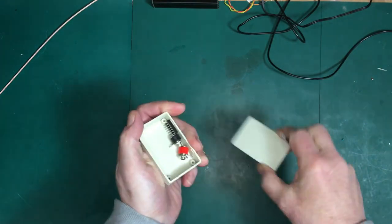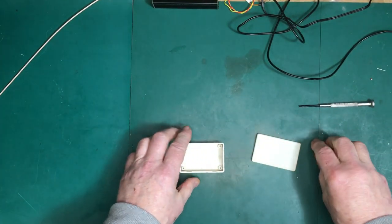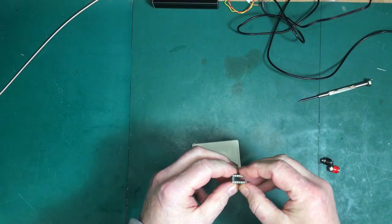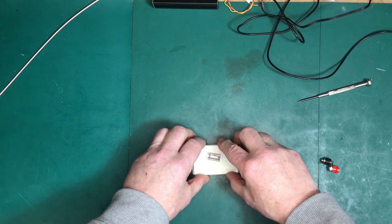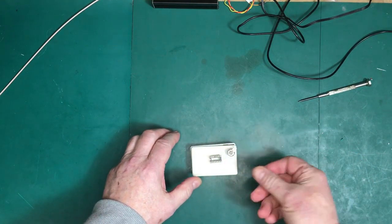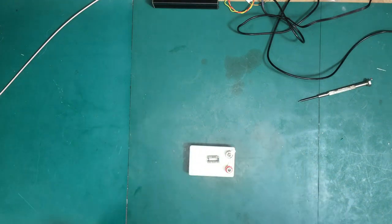The project is going to be just a little test jig so I can test oscillators — can-type oscillators. I'm going to have a socket here and a couple of banana jacks to apply some power, and then I'm going to put in a BNC connector here to get the output and put it into a scope.